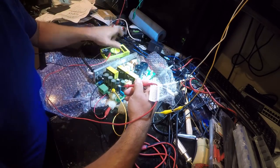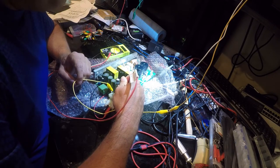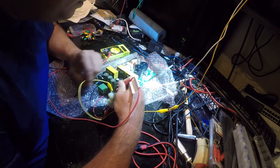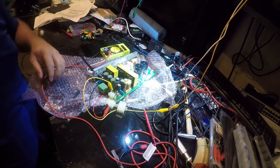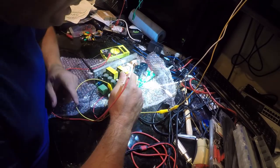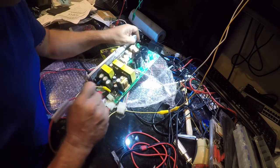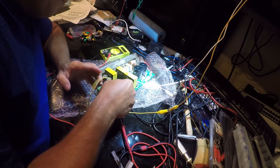So now what we're going to do is trace back to see where the voltage comes from. We've got 3 volts on that side and nothing on that side. That makes me wonder. I'll be right back. Alright, again, I don't normally work on this stuff, so what I wanted to see is, if I've got no voltage there and 3 volts there, this is my output diode down here, and its direction is that way. So what we need to do is move this over to there.